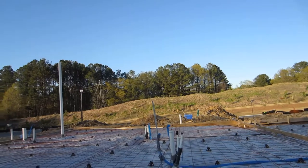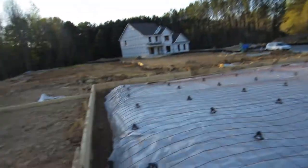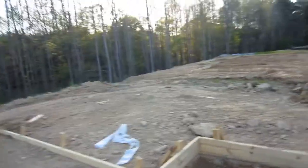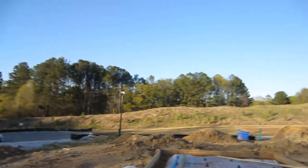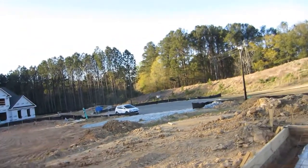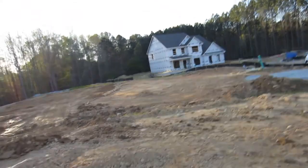Typically I'll go through and probe the footings — go around and probe the footings on a monolithic slab. I'll put up a diagram to show you what a monolithic slab actually looks like. They have a third-party engineering company that comes through — you can see the holes already in the footings — to probe for any voids. They'll submit an engineer's letter to me.